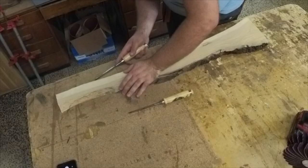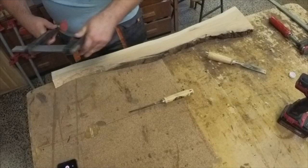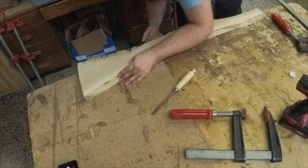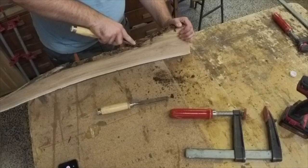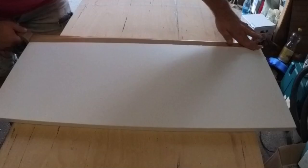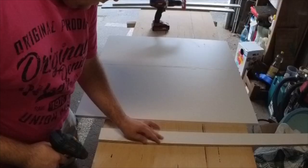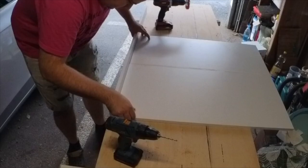When you are working with live edge, it's really important that you clean the live edge very well. This means that every bark and softwood must be cleaned and removed if you want the best bond between epoxy and wood. If you didn't do that, maybe you are lucky and the item you've built won't fall apart. If you really want to save the bark, you can do that with some additional steps — the steps being removing the bark, cleaning the inside of the bark and the live edge, and then gluing the two pieces together with epoxy.